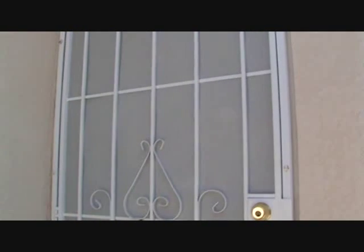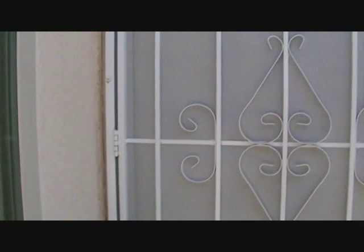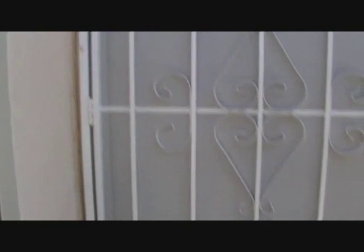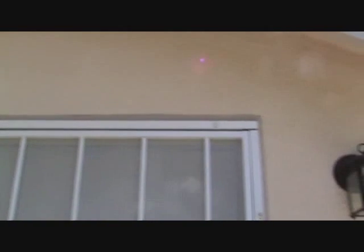There it is. I even looked up at the top, and it's just perfect at the top. The 1/2 inch really worked well on the side. I was a little amazed that it's not binding at all. What I found, this insulation could be just a hair less than 1/2 inch, just a hair less than 3/8 of an inch, because that gap up there, when I measured it before, was just over 3/8. Now when I looked up there, there's less than a 1/16 of a gap, and so that fit right on in.